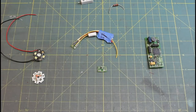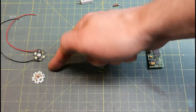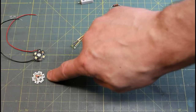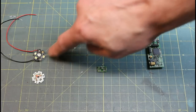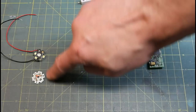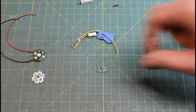When choosing your LED and whether you want to wire it in parallel or series, there are a number of things to consider. Here you've got an LED Engine LED and a Tri-Cree LED. The Tri-Cree is easier to wire up — the pads aren't as close together as the LED Engine — but the LED Engine has four dies while the Tri-Cree only has three. You can also get a quad Cree or quad Rebel, which would probably be the best choice if you can find the right optic.